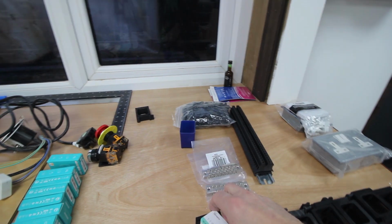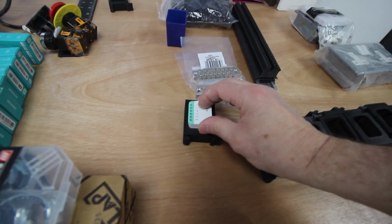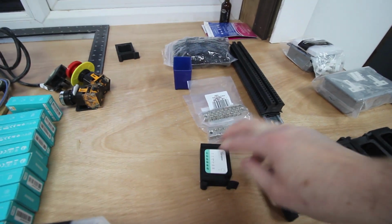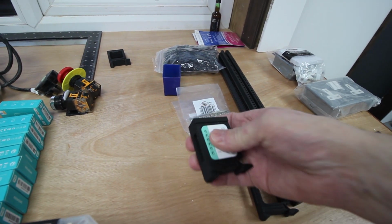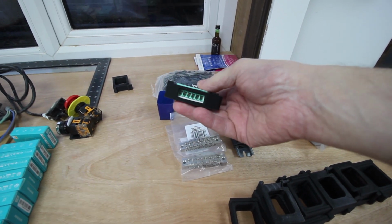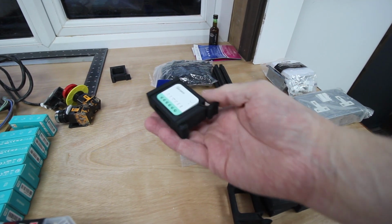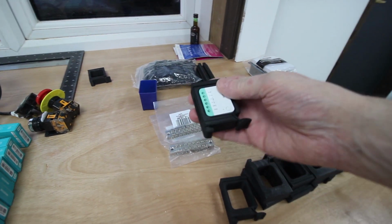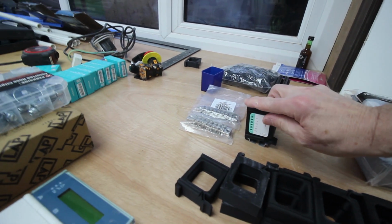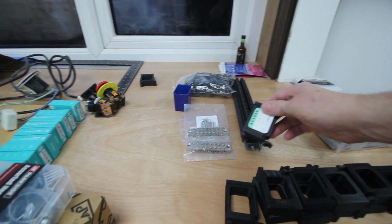This lighting system is going to be controlled by these little Sonoff switches, and they're designed to fit. Yeah, so you can see it. Designed to fit in behind a light switch in the box. So what I've been doing is printing off these adapters that make them so they fit onto a DIN rail. So you'll have to take my word for it. It's tricky to do one-handed, but yeah, that fits on there.